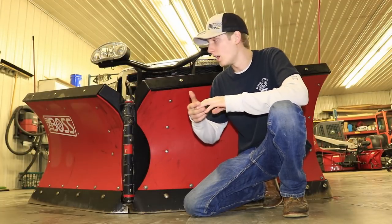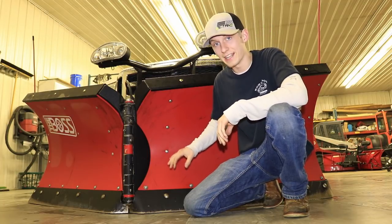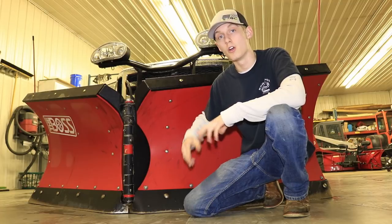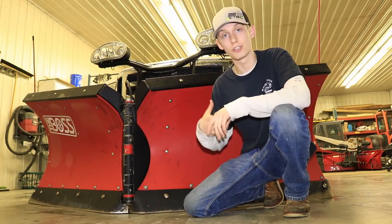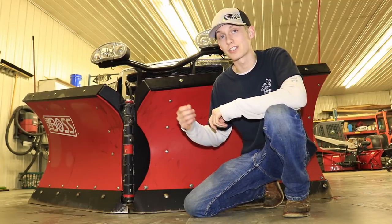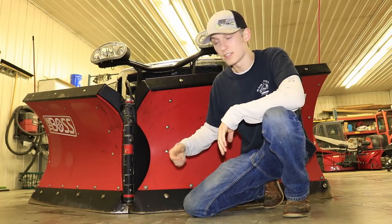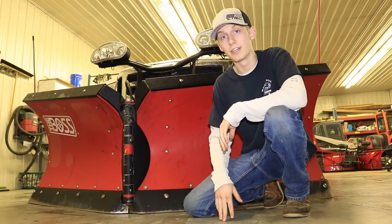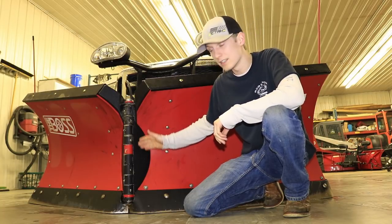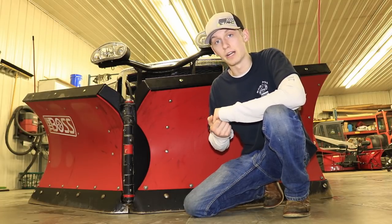Other than doing the grease, the white lithium grease, and having the shoes on, the number one other thing you guys can do to prevent these plows from going to hell is just washing them after every time you use them. Every time we get done using the plows, the trucks, the trailer, or the skid loader — anything that's been out in a snowstorm where there's salt and chemicals on the road — we wash them every single time without hesitation. I do not care if it's going to snow the next day because the second those chemicals hit your truck with that water they start to corrode the metal, and the second they get pulled into the shop into that warm heated area, that speeds up the corrosion process even faster. So washing the plows and greasing the V-plow column area is by far the number one best way to help maintain these plows and make sure they're around for the long run.